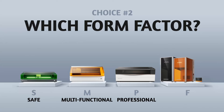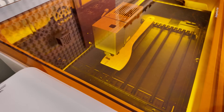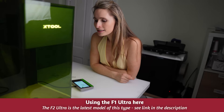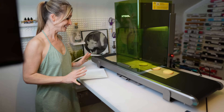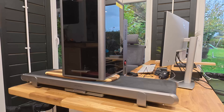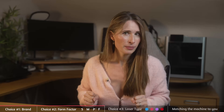And then there's F, which stands for fast. This is where Xtool shifts to a totally different design focused entirely on speed. Instead of using a gantry, they use a galvo system which doesn't move the laser head around like a CNC or 3D printer — it just tilts a mirror really, really fast. Traditional gantry lasers move at hundreds of millimetres per second; galvos do tens of thousands. So the P range is speedy, but the F range is blazing fast. The trade-off is a smaller working area, but this is amazing for smaller objects and designs. Speed and precision are the hallmarks of the F range.